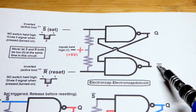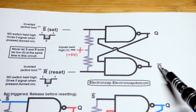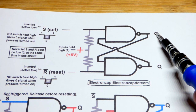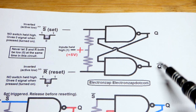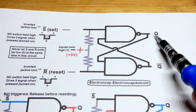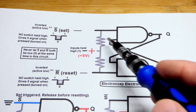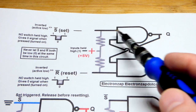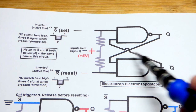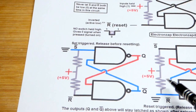The output: one of them is going to be high while the other one is low. That's what Q-bar means — whatever the output is for one, high or low, the other is the opposite. So if this one's low, that means both inputs are high; that's the way NAND gates operate. If we give it a low input, that will set that output high. We'll have two highs there, that'll set the other one low, and lock the first one high. I color coded it right there.